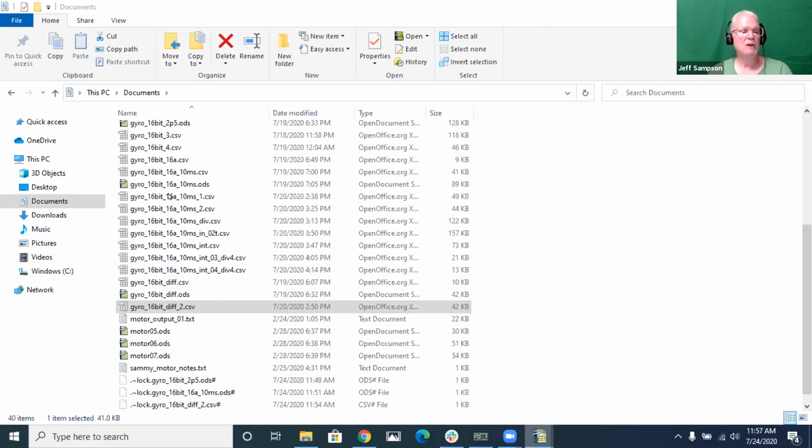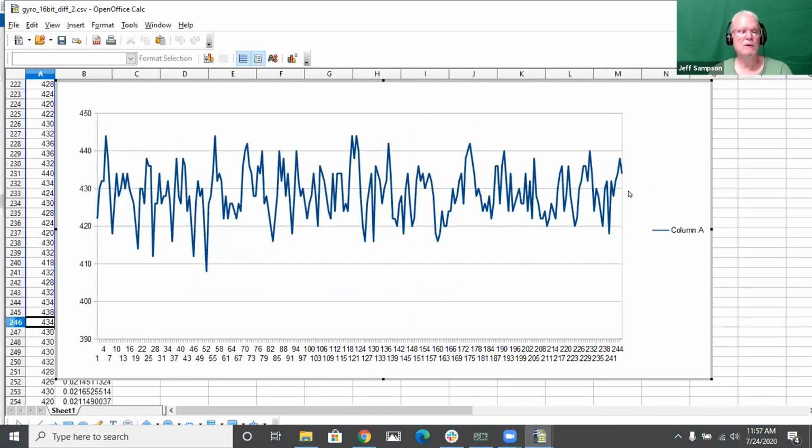What you need to do is figure out the averages and say, at zero movement, what's my average number? So when you start it up, average like 100 values or something. In this case, it looks like 430 is about the average value. Then you take the 430 and subtract it from every sample, so it says 0. Once you start the loop, each time you take a new sample, you just integrate that value in.